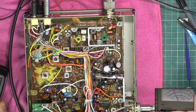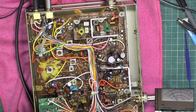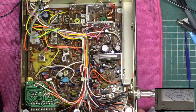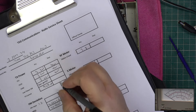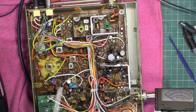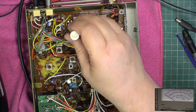Right — I'm back. It's 4 watts on channel 20, 4 watts on channel 1, 4 watts on channel 40. Current consumption is now 1.105 amps. Let's put some switch cleaner on that preset for low power and let that soak in.